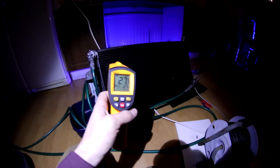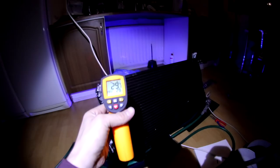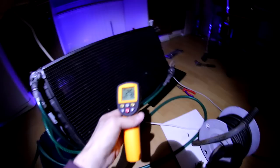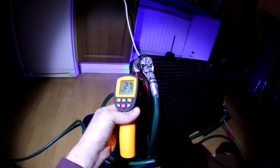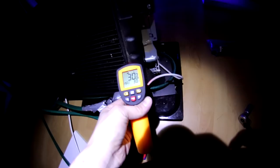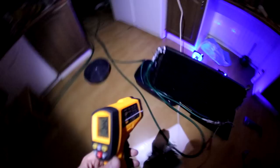IR gun acquired. So let's see — the outlet is 29°C. And the inlet — 27°C. It should measure reasonably well: 27 on that side and 30 on that side, so we have about 3 degrees of drop. Almost 31 going in there, 30.6 right at the inlet, and right at the outlet we have 27.4°C — so not super high temps.